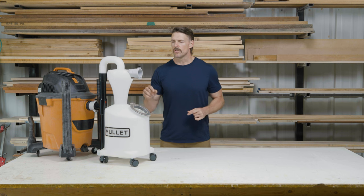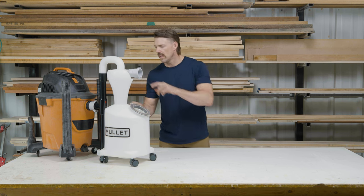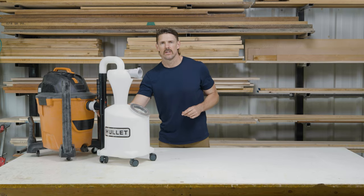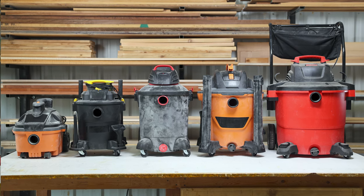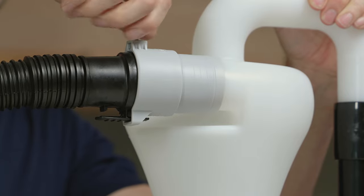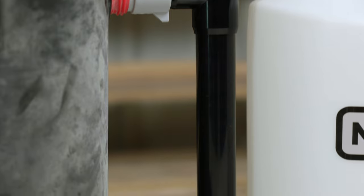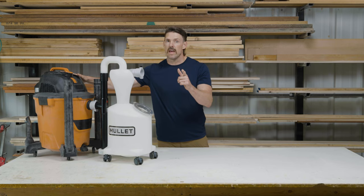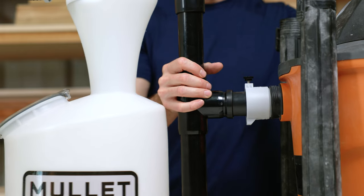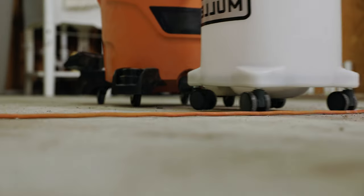The M5 is also fitted with two hose adapters — one on the front on the inlet and one on the back on the exhaust. That means you can connect to virtually any brand wet dry vacuum out there and its hose system on the front end. We also have an inch and a half PVC connection to the vacuum. It's a fully integrated connection, meaning you can tug it around the shop floor over seams and power cords without an issue.